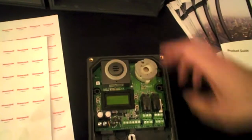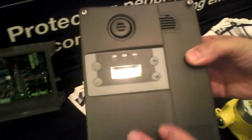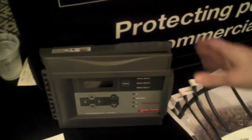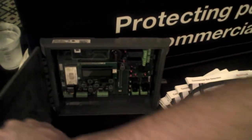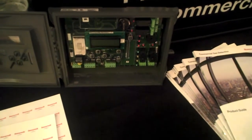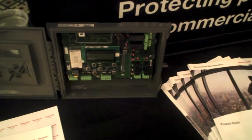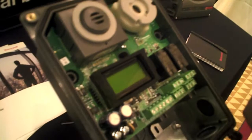So first let's discuss the E3 Point. This is the new sensor — it's been about two years now. The E3 Point can be purchased either as a standalone, network, or standalone dual. If it's network, it connects with our famous 301C controller that is capable of monitoring up to 96 transmitters. It's got three channels, 32 sensors per channel, low voltage, and you can do events and programming as much as you want — so you can have 10 sensors triggering one fan at once. The E3 Point can also be a standalone with BACnet or standalone with two dry contacts and a 4 to 20 milliamp.